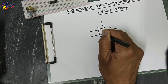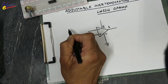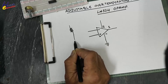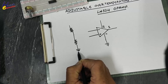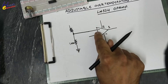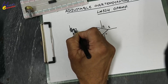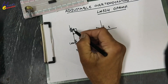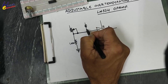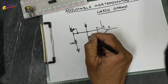For the inverting input and non-inverting input, I will use a 10K potentiometer to provide the reference voltage. We will make a voltage divider network with a 10K pot and a 10K resistor. This center node will connect to the inverting input. We will use the slider arm to tap the voltage. I will also use a 10K NTC with a 10K potentiometer and 10K resistor.